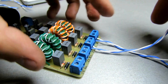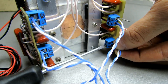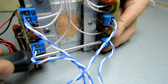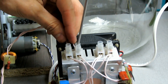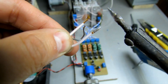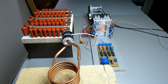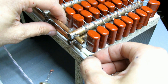We connect the generator and the power bridge, tightening the screws in the connectors as tight as possible. If during operation any wiring comes loose, all four transistors will burn in a bright flame with spectacular effects. For simplicity, all parts are located on a piece of plywood. We connect the wires to the power and matching transformer — it is advisable to tin all ends before use for more reliable contact. We are not in a hurry and we do everything properly. Now we connect the cooling system and coat all the tubes with waterproof silicone.